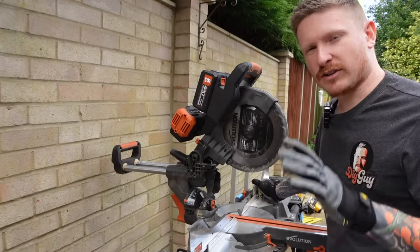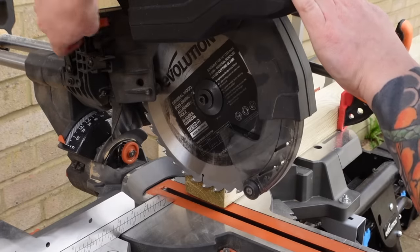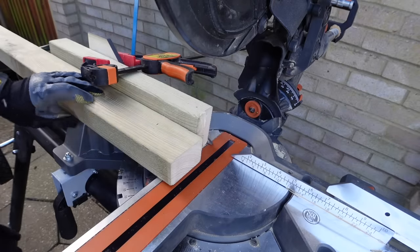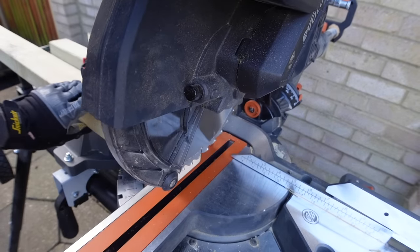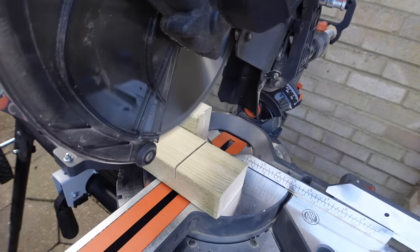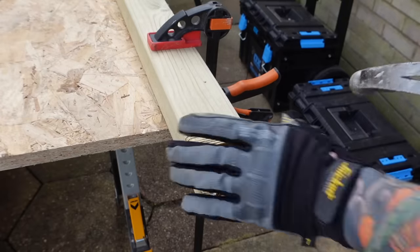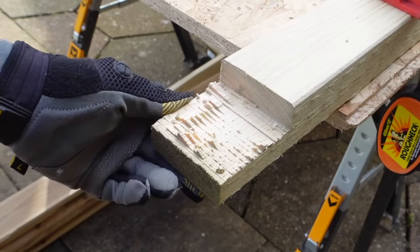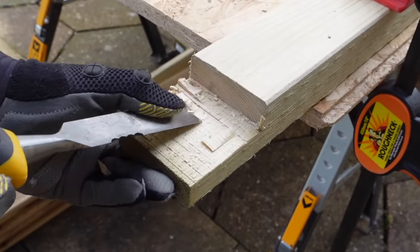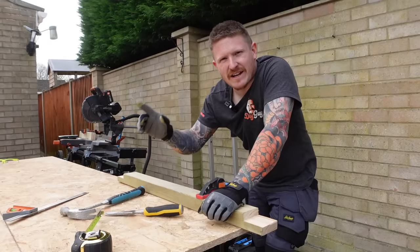There are a few ways to cut a half lap joint; I'm going to keep it simple and use the mitre saw with trench cuts to remove the material. I use the depth adjustment to set the saw to cut 22mm, and I've clamped another piece of timber here to pack this piece out so that my saw blade falls right in the middle. Then I make a series of trench cuts across the timber — keep all the cuts nice and close together — and use a hammer to knock away the majority of the material. Then use a nice sharp chisel to remove the rest. This is by far the simplest method. Repeat that for the rest of the timbers.